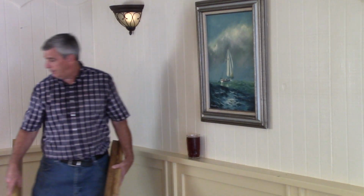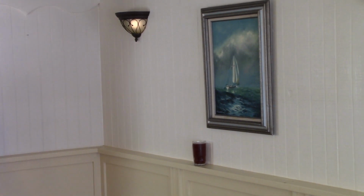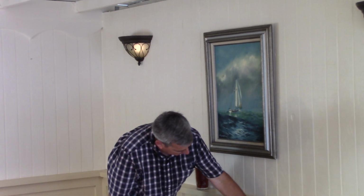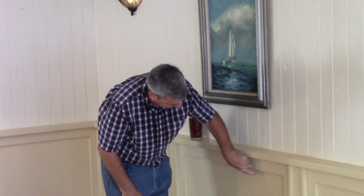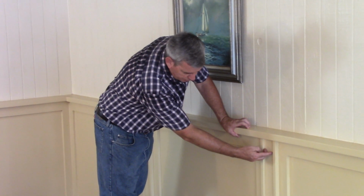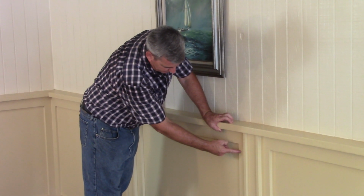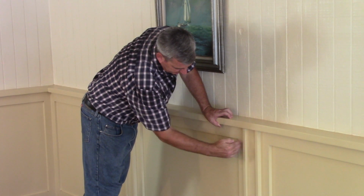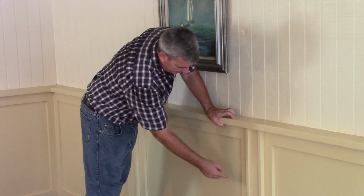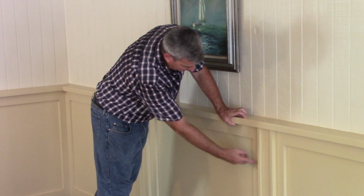And then what I do is, keeping with building on a budget, I use 3/4 inch plywood. And I just rip it to width. And for example, right here, I'll put maybe 2 pieces of 3/4 inch plywood on it, and then I have one here. So I'll put plywood on the sides, plywood stacked in the middle, and that'll make my column. And that's what hides my seams, because these are 4x8s. And then I'll wrap them.